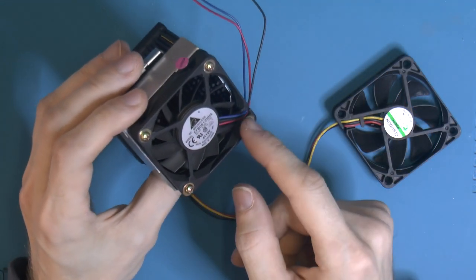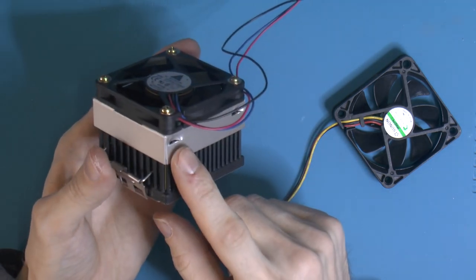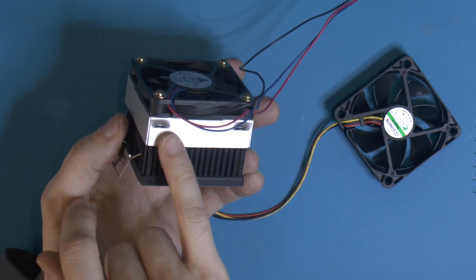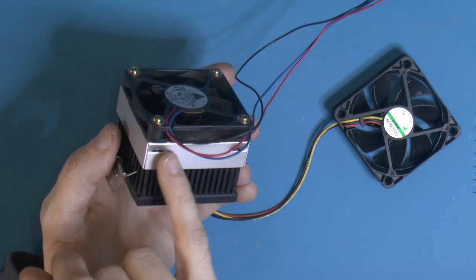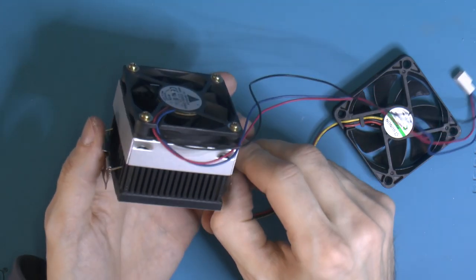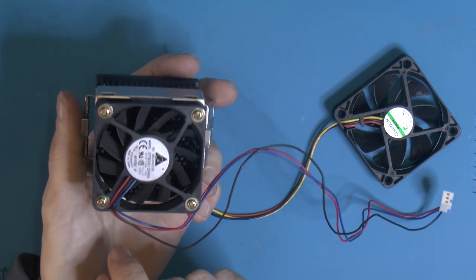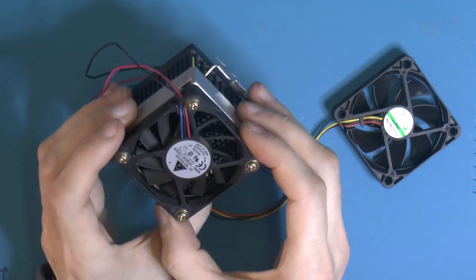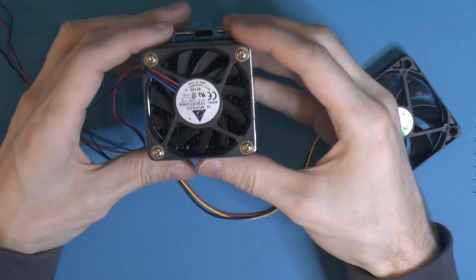Also, you can notice that these fans were in pull configuration. That's also why they have this shroud here, and the notches here allow it to sit about 5mm above. If the fan blades are too close to the heatsink, they will make horrible noise when they're more or less licking the top. You get a very annoying noise from the turbulence created that way. So these heat sinks are designed for pull, not push. You can obviously run whatever you want, but you can clearly see that this is factory. So you can definitely run heat sinks in pull just fine, and these are essentially designed for it.